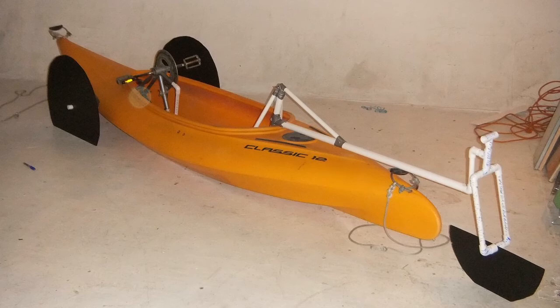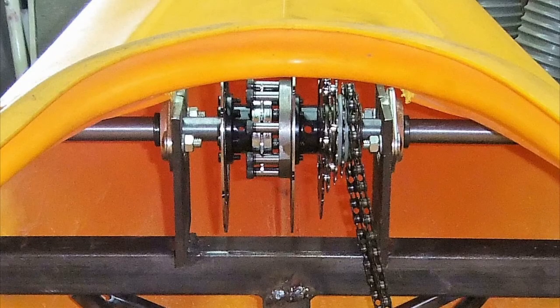I went online and soon found that most three-wheel bikes, or adult trikes as they're called, only drive one wheel. The clever riders who live in areas with loose gravel or snow and ice solved this problem with something I like to call a faux differential, which you can see here between the two disc brakes. You split the axle, put a normal sprocket with a freewheeling ratchet on one side, and then a single freewheeling sprocket like from a BMX bike on the other, and bridge across the two with shoulder bolts. It's not a true differential, but it does allow both wheels to rotate independently while driving both sides simultaneously. I took a photo of one of these faux differentials to my dad the next day, and he essentially said, 'Oh yeah, I can build that' — and we were off.